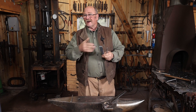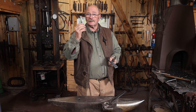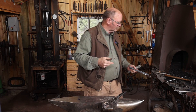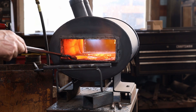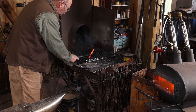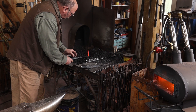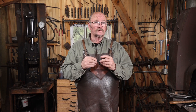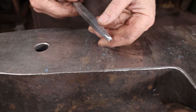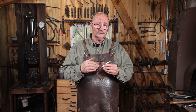I still need to grind this one and get it finished up so it'll be ready for heat treating. I don't think I'm going to show heat treating all these tools — I'll go ahead and show this one drift because we need to get back to work on the monkey tool, and that was the whole point of stopping to make all these tools. Once this is up to heat, I go ahead and stand it up with the struck end buried in vermiculite. In this case I just stuck it in the coal on the coal forge, and that will cool slower so it is not as hard and brittle as the working end of the drift. These don't generally need to be polished — they're going to get pretty bunged up and rough in use anyways.